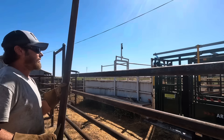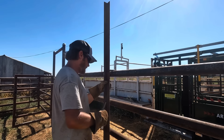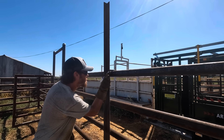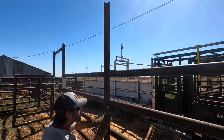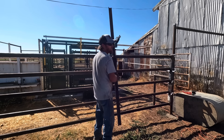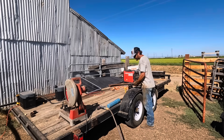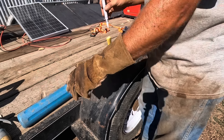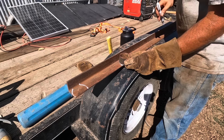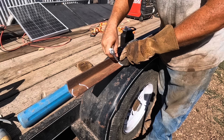I think the full-length 30-footers are around 200 pounds, so doing the math a 20-footer is probably somewhere around 130 pounds. Because I cut these with the porta-band, the cut side usually isn't a very straight cut — I'm just trying to do it fast. So I'll cut a short section off with the chop saw to get a good straight edge, then take my measurement and make my second cut. It's kind of a bummer because you have to cut it twice to get one piece.